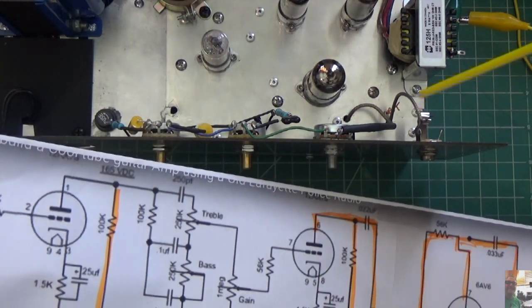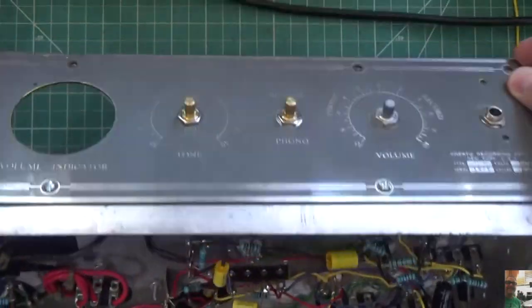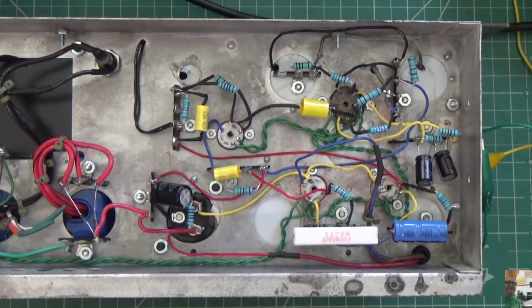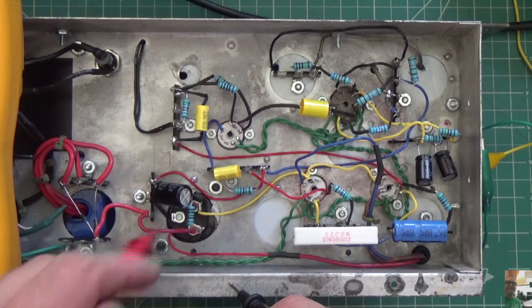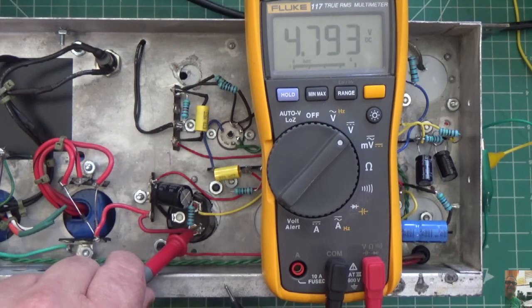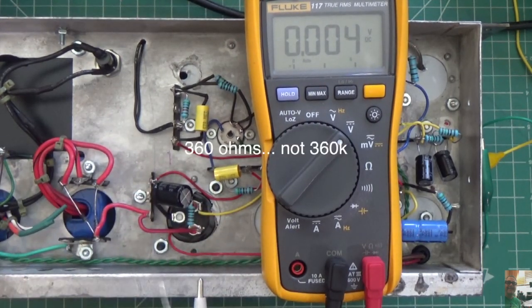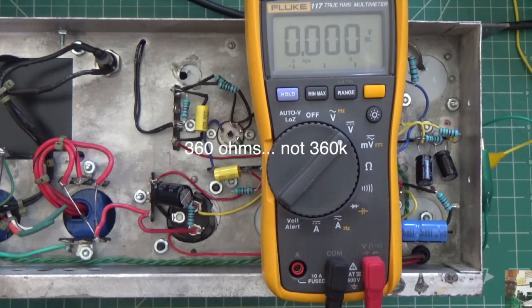In order to test my theory, what I'm going to do is completely cut this wire going to the jack. I'm going to flip this over. The first thing we're going to do is test this thing and make sure it doesn't have any voltage on it, because those capacitors hold the charge. Let's put this on DC volts. The amp is not plugged in. I'm still getting 4 volts somewhere. So we're going to take this 360K resistor, connect it to ground, and just touch the cap and discharge it. That electrolytic cap is now discharged.